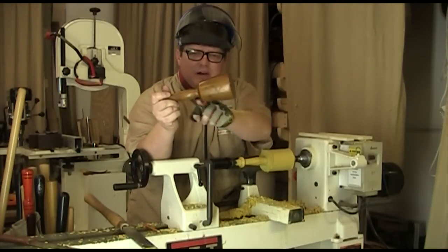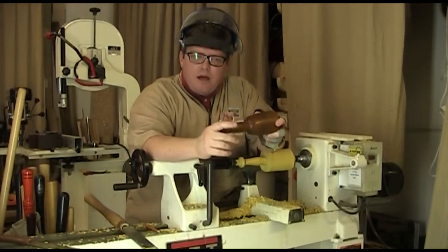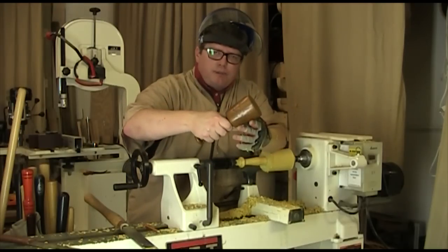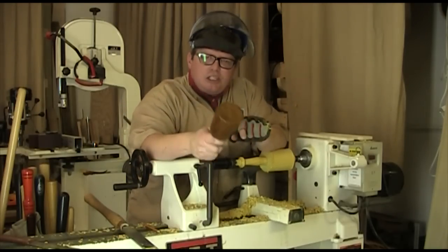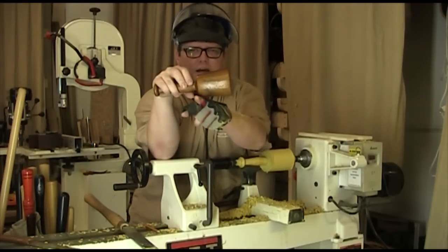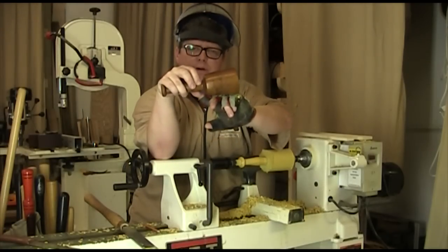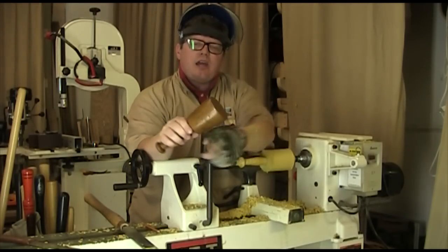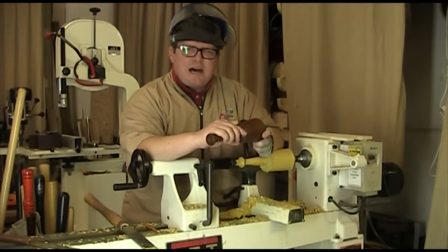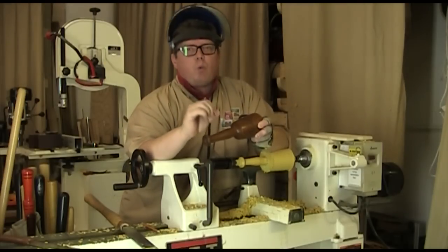Well, that slight angle and that slight curve really made a lot bigger difference than you would think, because I basically didn't have to angle my wrist as much, but that slight curve let me change the angle. So if I was hitting a very hard strike, I would just strike it a little bit closer to the handle side, and the curve makes the angle a little bit steeper. If I'm doing very light taps, I could hit it more towards the toe side, and the angle was a little bit slighter.